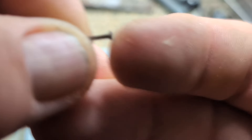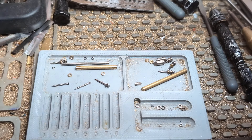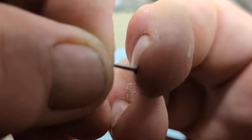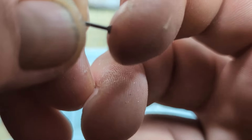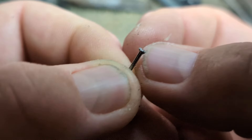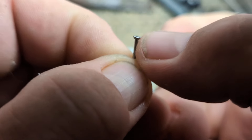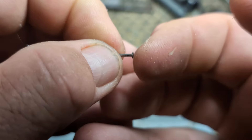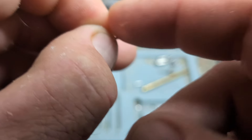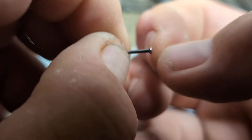This one I haven't done anything to yet — let me look at it under the light to make sure I'm not misleading you. There's a little metal flange right here, like a small ridge that connects the head to the shank of the nail. What I'll do is put it in my rubber tool, hold it steady, and take a file to smooth that down so it's good and round — so the wafers will sit perfectly on the back side of the nail head.